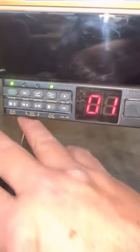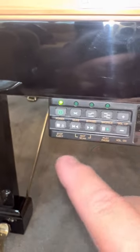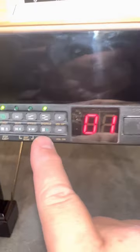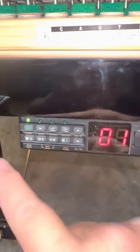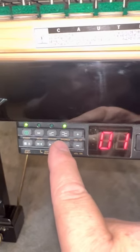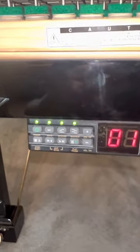Now remember this part: I'm done right now, and what you have to do is you don't push stop — you push the play button. If you push the play button, what it's going to do is take that data and write it to the ROM chip on the CPU under the piano — the EEPROM. So let's push play and it'll record what we did. Okay, there we go. Now we have done that.